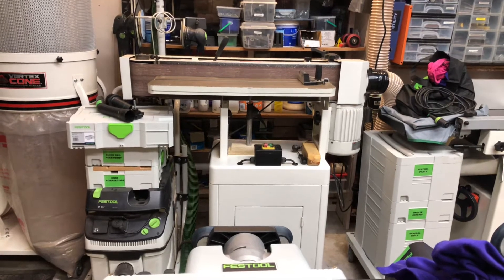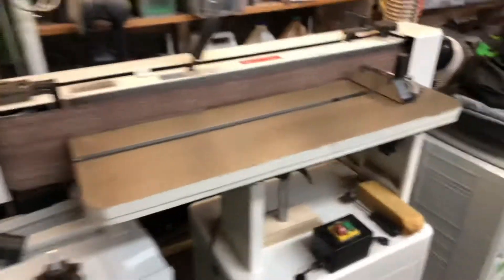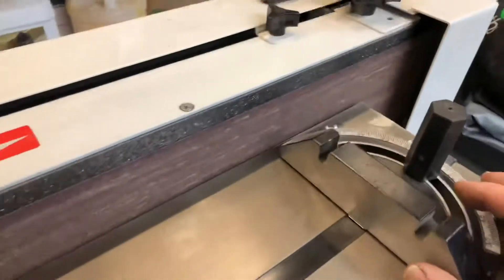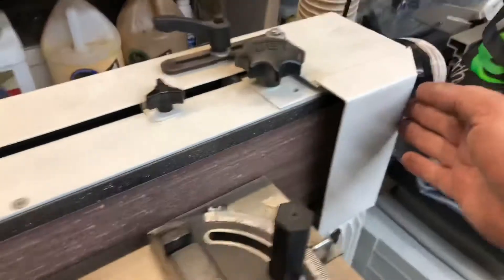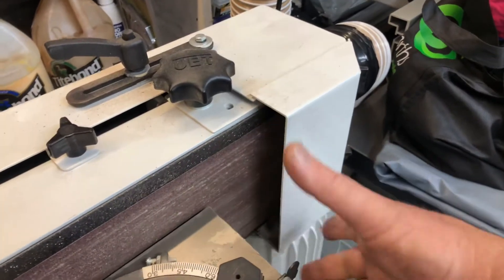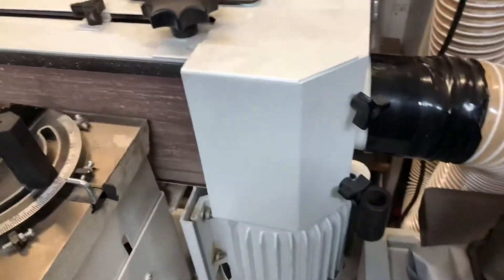Another criticism of this sander — it's a good sander, but this little bit here where they think the dust is going to get sucked through — you're dreaming. The moment you get something up here, there's no way it's going to pull it. This angle really needed to be hollowed out with a big gullet here to capture the dust that misses it. I'm actually going to make my own because they do a ratty job of it.